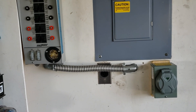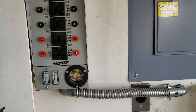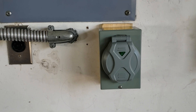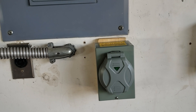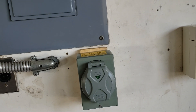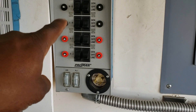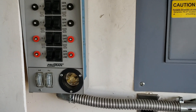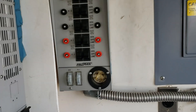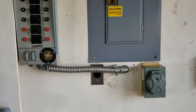One of the most important things to pay attention to when comparing a transfer switch versus an inlet box is grounding. If you're using a transfer switch, you can use a bonded inverter generator — that's fine. If you're using an inlet box, it has to be a floating neutral as per code. That's where the question of bonded generator versus floating neutral generator comes in. Inlet box requires floating neutral; transfer switch can be bonded. If you're going back and forth between the two, I understand it can be confusing.